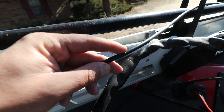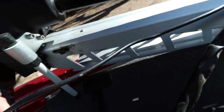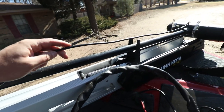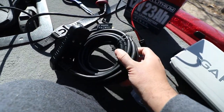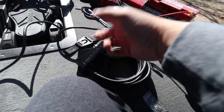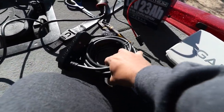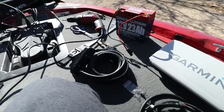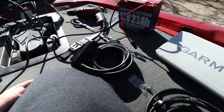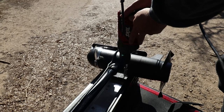I just got all these zip ties cut off of the transducer wire. See that mark right there from the zip tie? Everywhere there's a zip tie it left a mark and you can see it pinch the wire. That is why you do not want to use zip ties on your transducer wires — especially on this LiveScope wire. This is a thousand dollar cable and transducer. If you try to get a warranty with Garmin and you used zip ties, Garmin will see those marks on your cable and will not replace it. Using zip ties on this cable will void your warranty. Number one rule for installing LiveScope: don't use zip ties, use electrical tape.